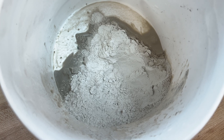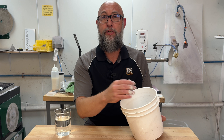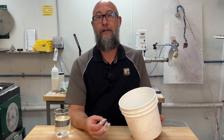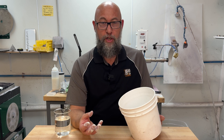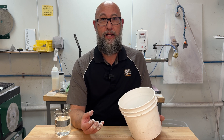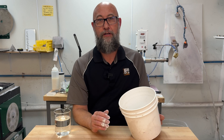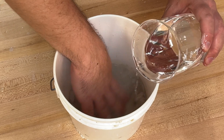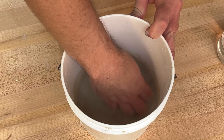As discussed earlier, pumice is a powdered material. I have some 2F pumice here — my double fine pumice. It is a powder, but you're not going to be able to use it as a powder, and you don't want it as thin as cerium either. You'll want to try and make a mud consistency out of the pumice. That's the way it's going to work best so it will cling to the glass and to your media — be it your cork wheel, your brush wheel, whatever. So I'm going to mix a little water in here to make a mud consistency, then we'll move over to our flat lap grinder.